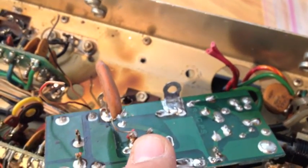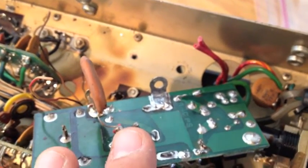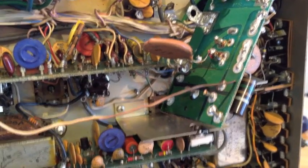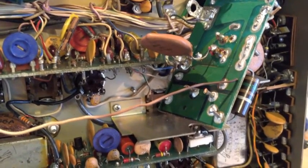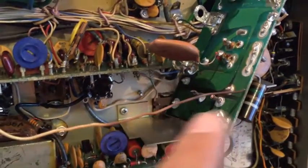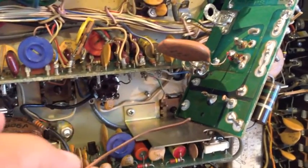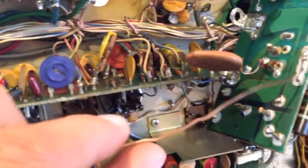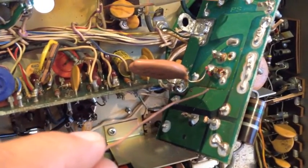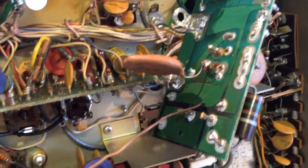There it is — R4CPS right there on the board. This will be gone in a minute. There's a 12-volt wire coming from right here. In the description they say it's white — look how it's changed. You can actually see it changes to white as it goes to the audio board. This thing has been so hot that it changed color. So if you find that you can't find the white wire, it might have changed its color.